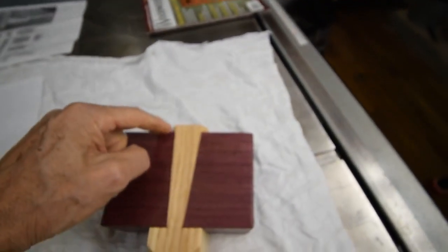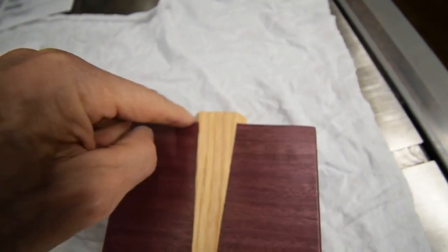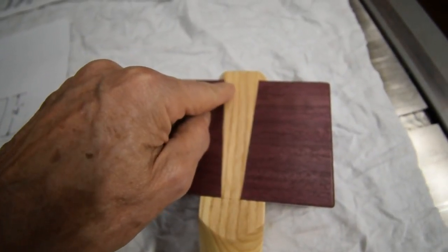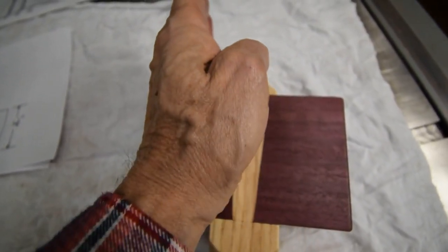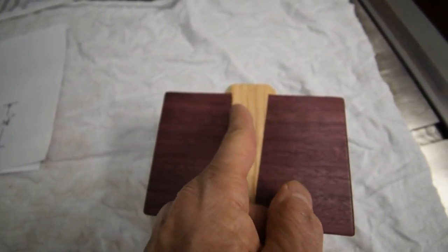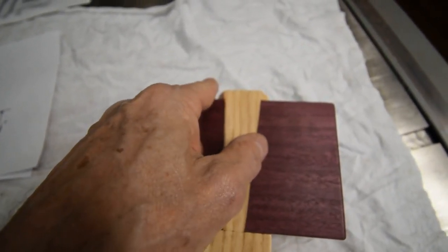One small hint, if you're going to extend your dovetails and tenon past the top of the head, when you do your marking, you're going to mark it from 4 inches up from the bottom. Now your dovetail is going to keep going wider. So from this point, on this one it was less than a 1/16 that I had to cut off, but you want to, from this point, square off and just chisel that corner back a little bit so that it stays square.